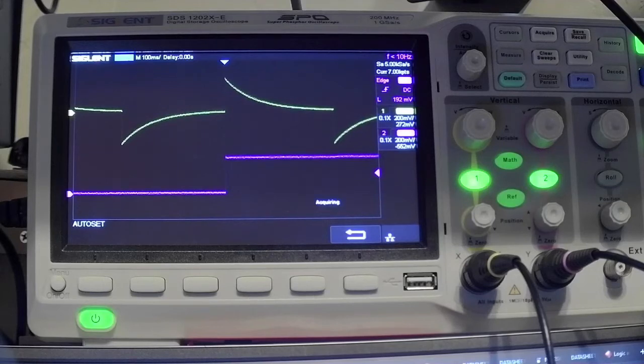So I've got this set to a very slow signal right now because it's counting, like 1, 2, 3, that sort of thing, almost 1 a second or something like that. And the signal generator that I'm using is at that low speed. As you can see, that's the clock signal up the top, the yellow trace, and it's not actually a proper square wave. Somehow it's suffering. But this is another reason why a logic analyzer is a good idea, because it will actually capture the signal and tell you whether it's being interpreted as high or low. And if it is a bit of an analog signal like that, then the high and the low can be in different places. But let me switch it to a higher frequency so we don't have that aberration there.